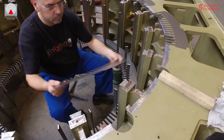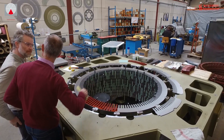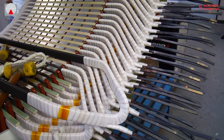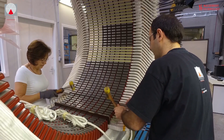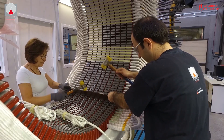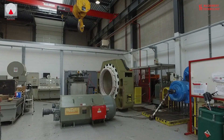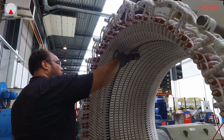The key to an AC induction motor, where the field of the rotor is induced by the field of the stator, is that the rotor is always trying to catch up. It's always looking for the stator, so it's rotating to find that steady state. But the electromagnetic field produced by the stator using AC power is always going to be a little faster than the rotor's field. The slip of the rotor is creating the torque needed to create mechanical power to turn the wheels of a car or the whir of a fan. Some AC motors use a wound rotor, which is wrapped with wire instead of being a squirrel cage, though the squirrel cage kind is more common. In either case, there's only one moving part in an AC motor, which means there are fewer things that need replacing or maintenance.